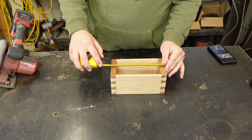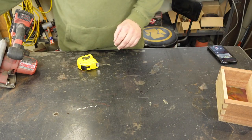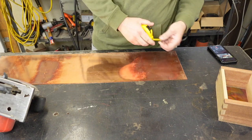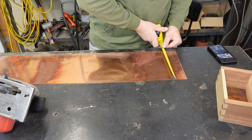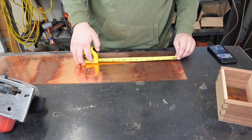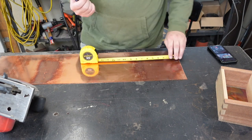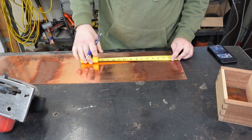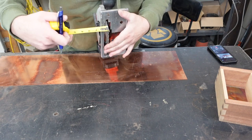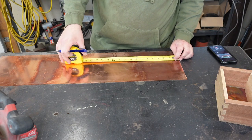So what I'm doing right here is measuring my box and looking at my material to figure out what size of lid I want to make. It turns out later you'll see that I made it a little bit too sloppy — I planned on an eighth inch all the way around and that is a little bit too much. So I'm going to grab a pin and mark my piece, double-check the box one more time, and check the offset from my blade to the edge so I can properly set up my straight edge guide.